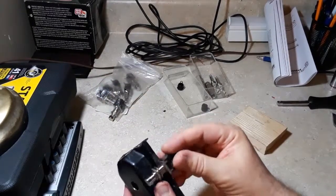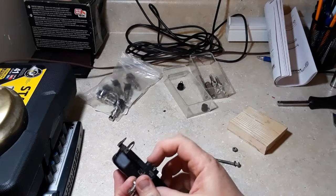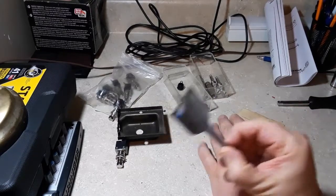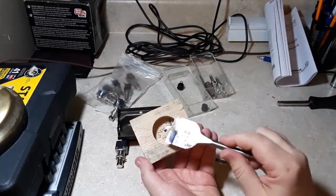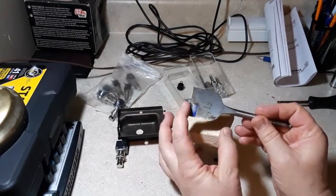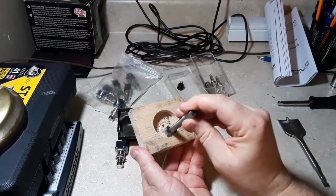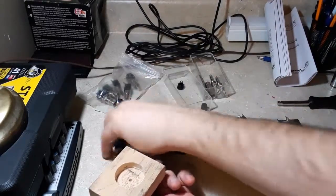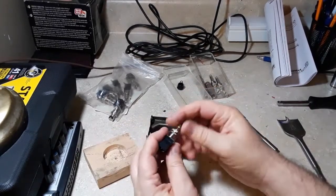When I installed this in here, I noticed there was not enough room coming out of the bottom — it was going to come in contact with this wood. So I had to do something about that. I got my one-and-a-half-inch spade bit and cut a hole in here, put it in my drill press, and hollowed out a cavity for the switch and the wiring to go down into. Unfortunately this spike almost went out of the bottom, so I had to finish it up with a Forstner bit — I just went around the circle and plunged it using my depth stop until I had enough hollowed out that the footswitch cabling can fit right inside there nicely.